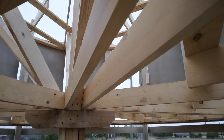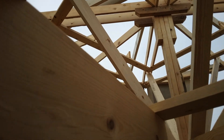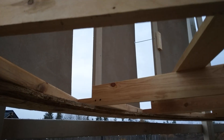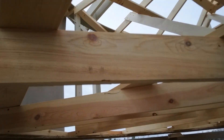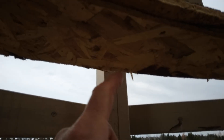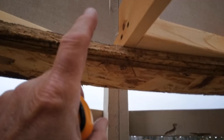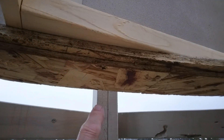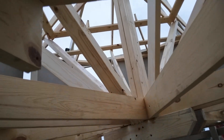And it's just slowly turning. I'm going to have three wheels under here — the turbine is going to be riding on the wheels. I have one right here, and that will be geared up probably about 10 to 1. When I put the wheels on there it will add some friction, but it will also take some weight off of the center shaft here.